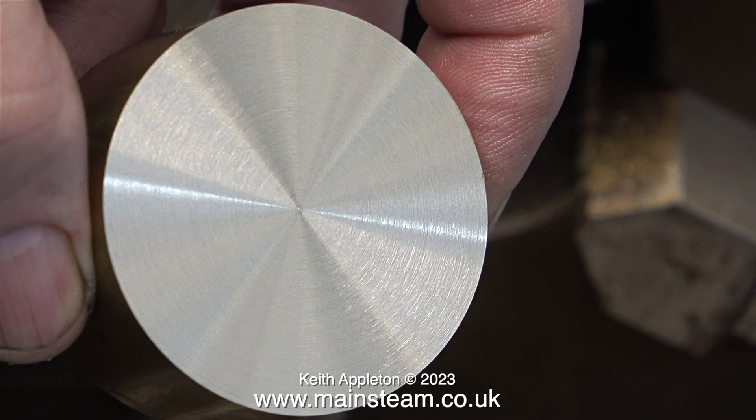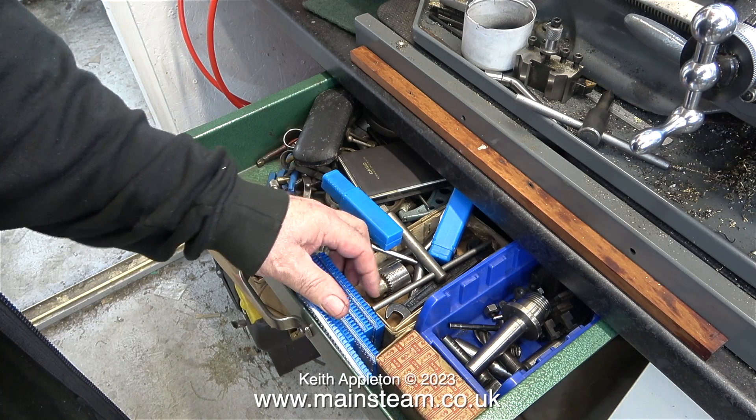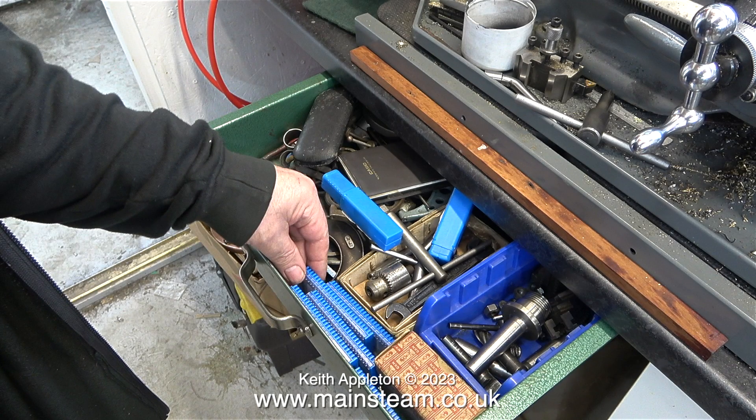This is not a brilliant finish because the feed was a bit fast. The reason for the fast feed was to do two things: one, make some rings in the work, and the other, just to speed up the job. You can clearly see the centre of this piece of metal. My Myford lathe sits on a worktop resting on foam pads — very unorthodox, but it's very true and it works well, and it's quiet. Underneath the workbench is a drawer; I made the runners for it but it's a bit crude — I think I'll buy some like I have in my other workshop. I keep assorted pieces of tooling in this drawer, but I'm running out of space.